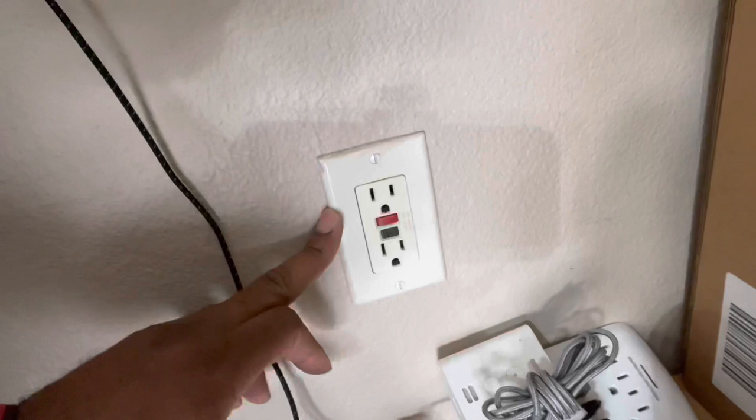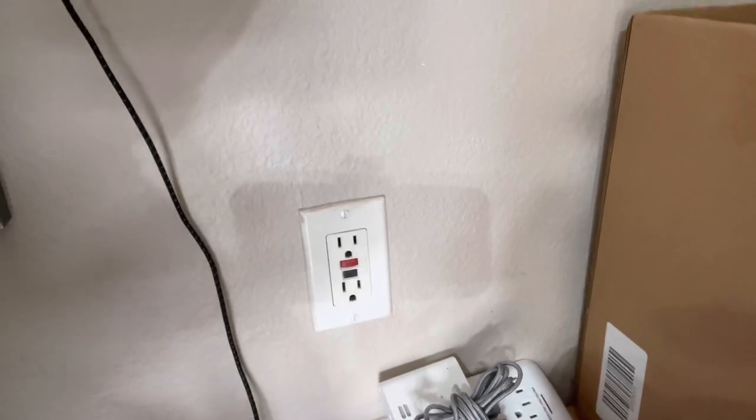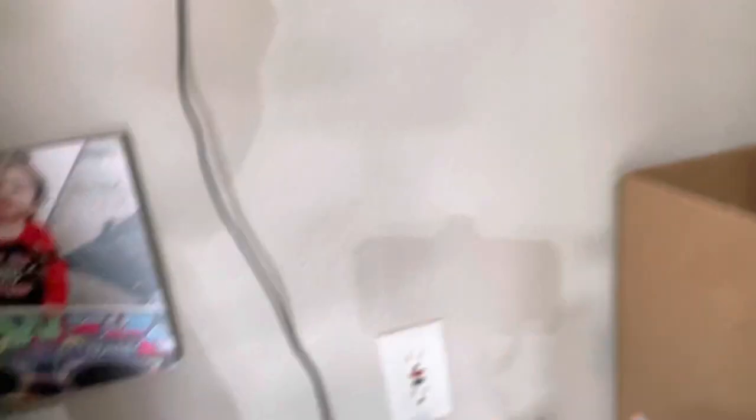Initially, when I first started using the Tesla charger, I used this regular GFI outlet right here. What was happening is this outlet is connected to all the GFI outlets in the house — upstairs in the kitchen, some of the bathrooms — they all run on the same circuit. I was constantly getting the outlet tripping, so I wasn't able to get a stable charge. When a Tesla is charging, it runs at roughly 12 amps continuously. If your GFI has other things on it, it's going to get warm, get hot, and end up tripping all the time — which is exactly what happened. It was very, very frustrating.